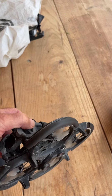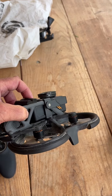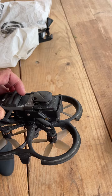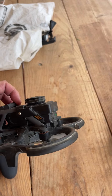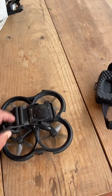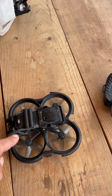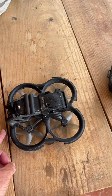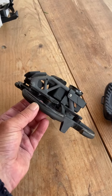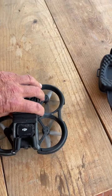You can see the ducts. I tried those 3D printed ones that the original Dobo uses and sells, but I found they actually affected the flying of the quad because the little clips go over here and here, so it's affecting the air and you've got something sticking out a lot more. It's plastic. So what I've done is stuck this on with double-sided tape — very good. I do it on a lot of my drones.